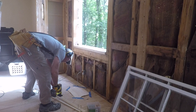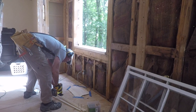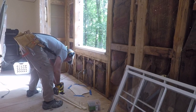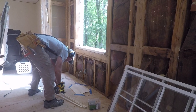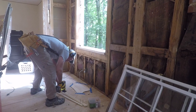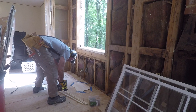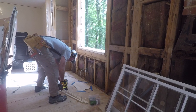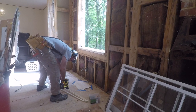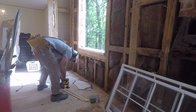What I'm doing right here is making some furring strips — they're about three-quarter by three-quarter inch. Because of the dimensions of the Pella window, it's five inches, whereas the windows I removed were four inches. I actually need to move the outside of the window further out so that the flush mount fits perfectly. I can run the drywall straight up to the frame so that the casing fits snugly against it and doesn't wobble or have a big caulking gap on the inside once I put the casing on. That's what the furring strip is for.